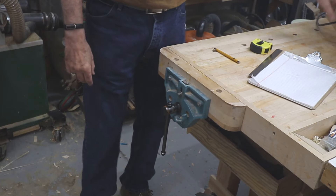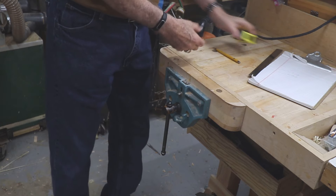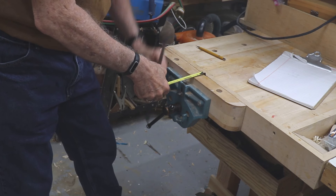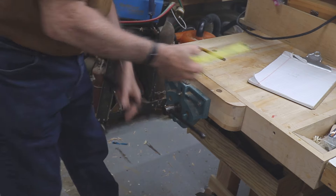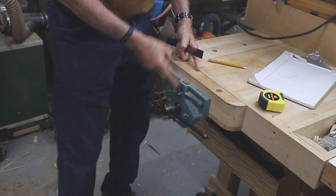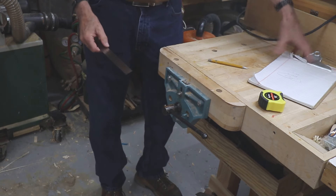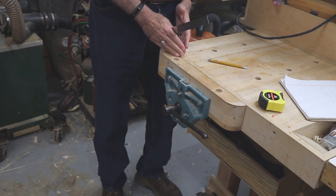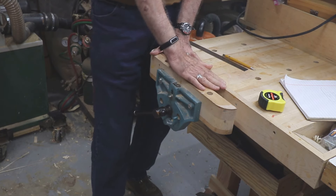The front of the box here has to be beyond the shaft for the vise. So let's get that measurement — that's five and three-eighths. And for a little bit of slop, we'll go five and five-eighths. So this will be out beyond the vise well enough. Now, the other thing I need to do is run a bench dog into the bench back here in the back of the platform to hold it nice and tight. What I'm going to do is put a cleat on the bottom that goes into here, then clamp down on that cleat, and now that holds the platform in tight.